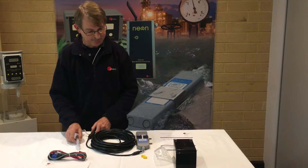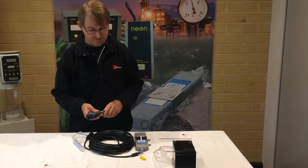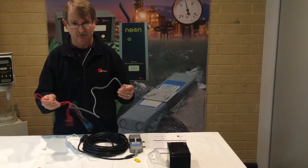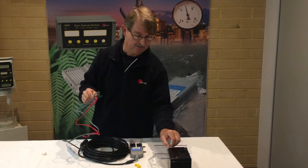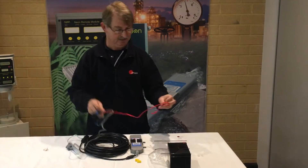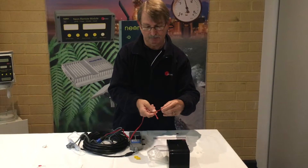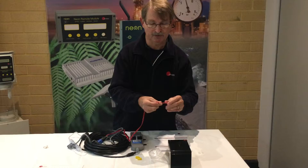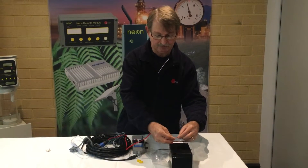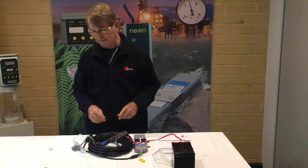There is a little packing screw you might need to remove from that end — it's just a simple case of sliding it onto the nozzle and then cable-tying it into place. That's the drying tube done. We next move on to the communications cable, which is used to interface the Starflow instrument to the computer and to the battery. Remove the two protective tags off the battery. This end of the cable has a black stripe on one of the conductors — the black stripe indicates the negative battery terminal, and the solid red conductor goes onto the positive side of the battery.